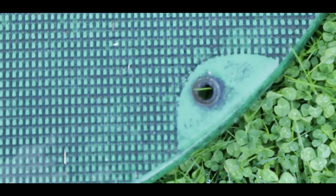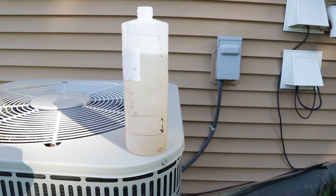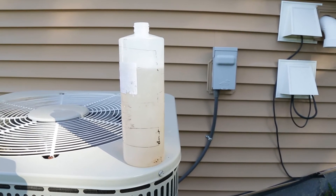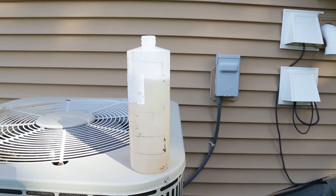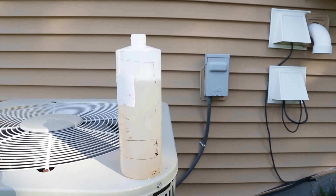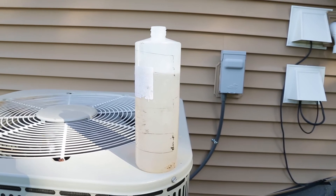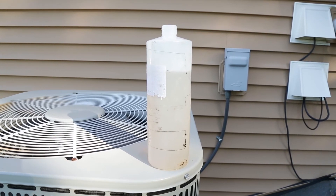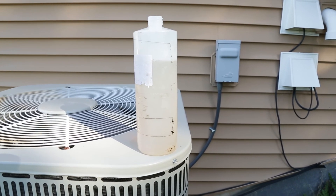Here's the sample. If you run it through the turbidity meter you'll get an NTU reading. NTUs typically correlate to BOD and TSS measurements. Any NTU below 15 to 20 will probably pass BOD and TSS; any NTU above that might not pass. Also, if you've got a full sample bottle, you can look straight down into it — if you can see the bottom of the bottle, you're going to pass BOD and TSS as well. A pretty easy eyeball test.